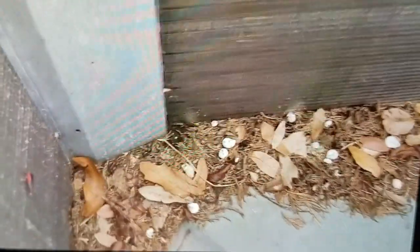These condenser coils are very delicate. Become quite deteriorated over the years, which is understandable. Aluminum, it oxidizes. See where I touched it there? I just barely touched it with my finger. But I think I can clean things up here and get her breathing a little bit better, maybe a lot better.